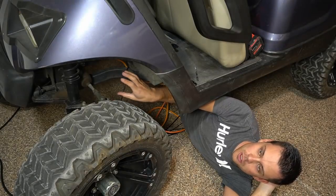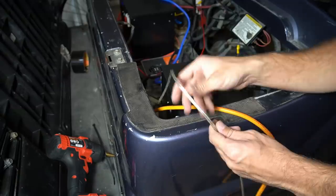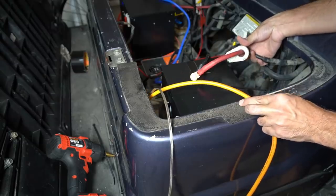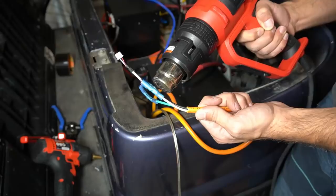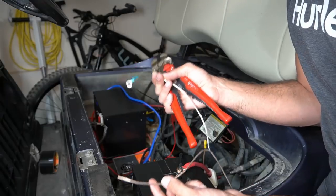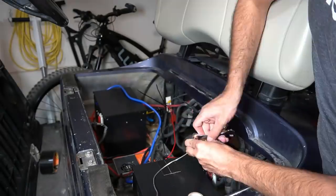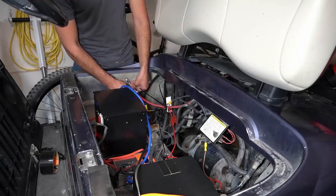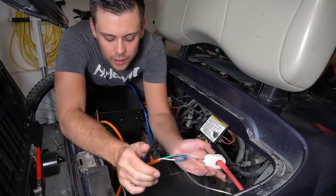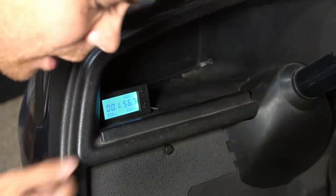There are a lot of moving parts here so I'm trying to attach the wires as close to the chassis as possible. These two conductors are for voltage sensing and they go out to the Hall Effect Sensor. The coulomb meter has its power lines connected directly to the battery, so we're going to add a small fuse. Now that the meter is connected to the battery we can plug in the Hall Effect Sensor, turn it on, and check it out — it actually works. I'll probably need to calibrate it but I'll figure that out later.